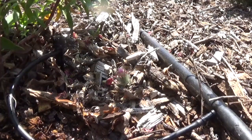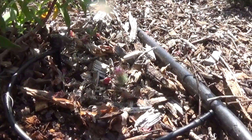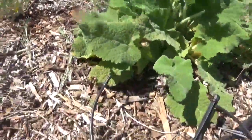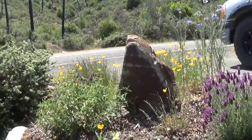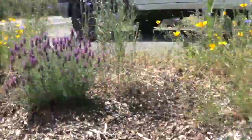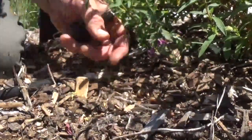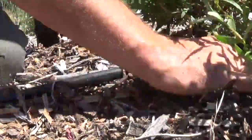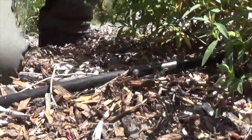And that's the other important thing to remember, is on each run there's a maximum amount of water pressure that you have, and that will determine how many different emitters you can have going at one time, and that's how many lines you have to break off with on and off valves and make them take turns. So that's an important number. Let's do the number. I'm no expert in all this. And that's the point, is I just want to show you that you can muddle your way through this by knowing some simple rules. You know, I got to work as a landscaper and get taught the different techniques and stuff and see it all.